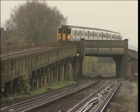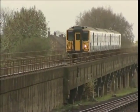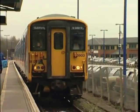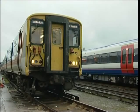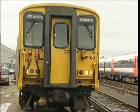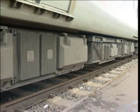In this program we'll look at the principles and procedures for dealing with the most common faults and failures on the Class 455 electric multiple units operated by Southwest Trains. The Class 455s fall into three subclasses: 5700, 5800 and 5900 series. The 5800 series represents the class standard, while the 5700 series differs only in the non-driving trailer vehicles which have been taken from older Class 508 units. The 5900 subclass is essentially the same as the 5800, but five units in this series are equipped with thyristor controlled chopper traction equipment.